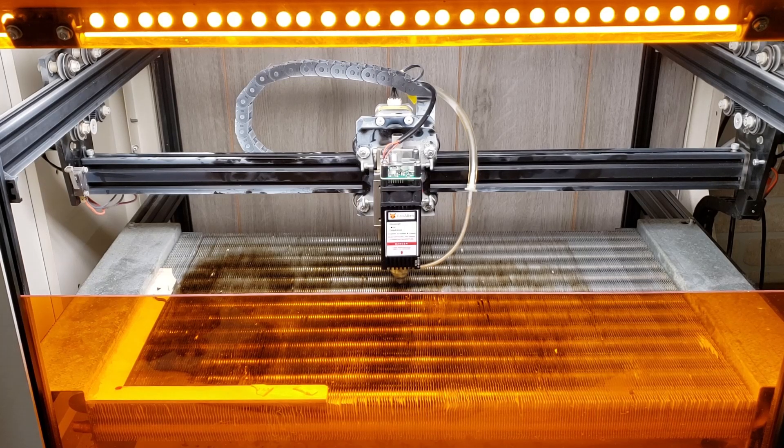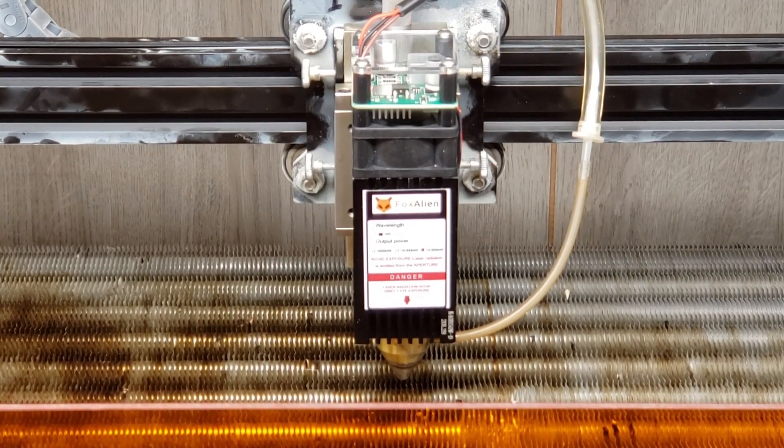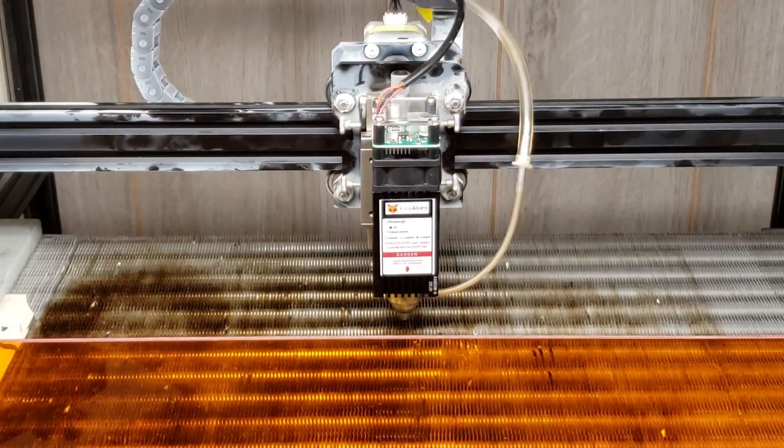Supposedly a 15 watter, the optical output they told me is about five to five and a half watts compared to the previous seven watts out, but that is because of the losses that occur when you try to correct beam shape with better optics. This might be a multi-element lens. What I do know is that my preliminary tests showed that this thing cuts extremely well. I made my own little air assist nozzle and I think it works very very well with a nice strong blast.